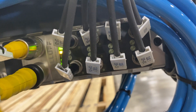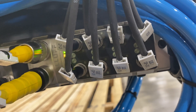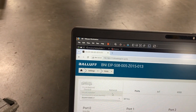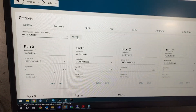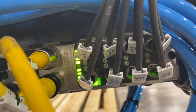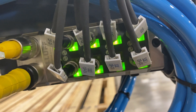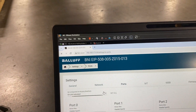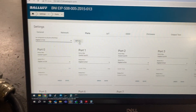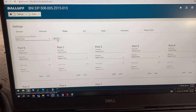Notice all the ports go to off — they're in digital mode and not communicating in IO-Link. If you go back and try to put it in IO-Link mode and hit Set All again, you're still not communicating. What you have to do is power cycle the module with it set to digital in-out on all ports. Hit Set All.